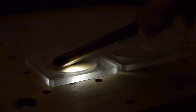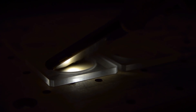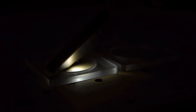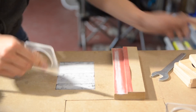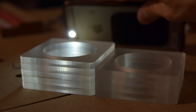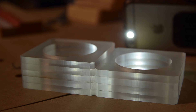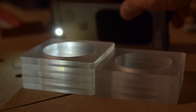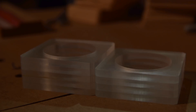The texture isn't perfect, but the walls were clear. If I had a finishing end mill, they would be even better — and if I'd used a laser, things would be almost too easy. I tried sanding up to a thousand grit on one set of the acrylic pieces, but it felt too tedious and time consuming to do for both lamps. The improvement was just marginal. That being said, if you opt to flame polish after hitting a thousand grit, you'd probably have a near glass-smooth surface. But a little frosting isn't a bad thing in this case — it'll help diffuse the light.